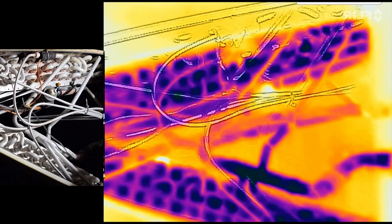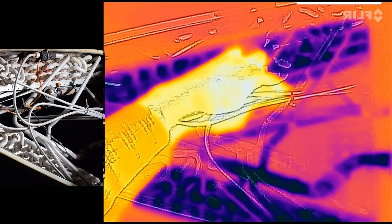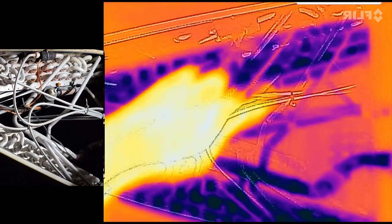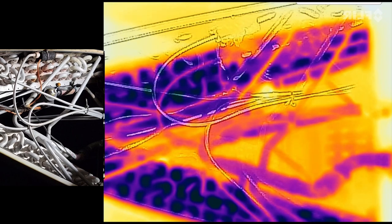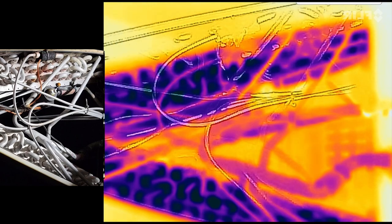You can see the refrigerant flowing through the circuits. Our expansion device is right here. So you can see how it's changing from a high pressure liquid coming in to a low pressure saturated mixture. And as that pressure drops, I also have a temperature drop, and you can see the coil where the refrigerant's changing state from liquid to vapor, absorbing heat. That's where that lower color blue is.